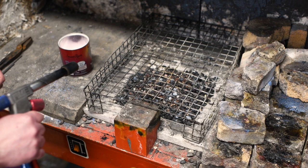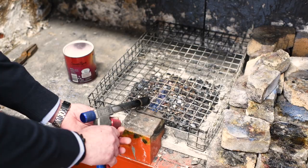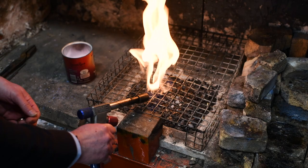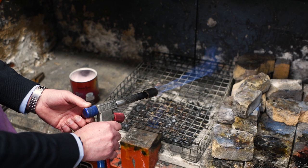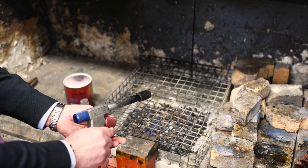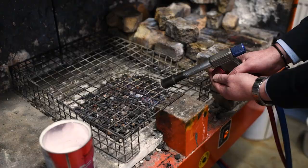To start, I'm going to turn on the blower — the pilot light as before. So we have the pilot light showing. I'm going to bring the torch in, the nozzle is resting, and I will turn on the red gas so we get our yellow flame. To demonstrate bringing the air in, I'll bring the air in and we can see that the yellow flame turns to a blue. When switching off, we turn the gas off first so that all we have coming out is compressed air, and then we turn the blue air one off second.